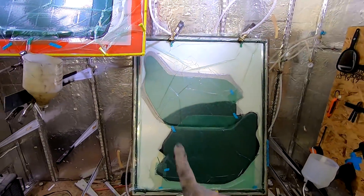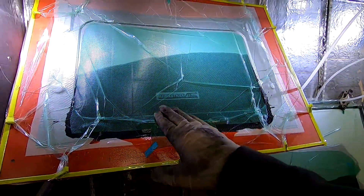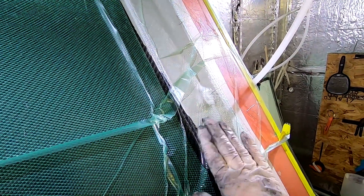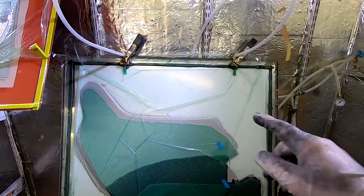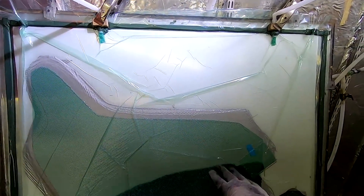So I'm going to stop the time-lapse real quick so you can see it in real time. You can see all the little bubbles of air kind of working their way out throughout the laminate - that's kind of why we do an uphill infusion, because air obviously rises so it's just easier to stay in front of the resin front. Same thing with this one - uphill infusion. You can see how once it gets to the edge of the flow net it really slows down, so it was able to make it this far through the flow net but only this far into an area where there's not flow net. We stopped the flow net a little bit prior to the part edge and we give ourselves plenty of resin break - the only thing from the end of the part up to here is peel ply. Air can travel through the peel ply but it's very difficult for the resin to make it through.